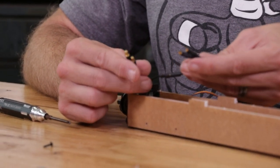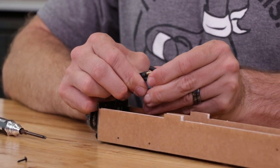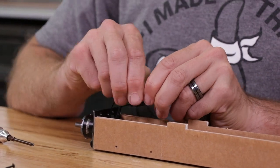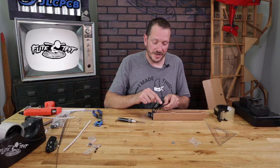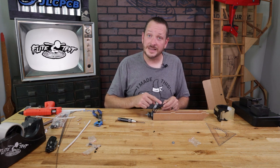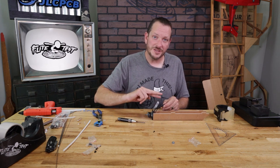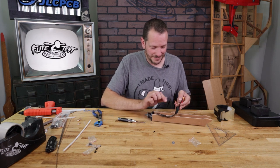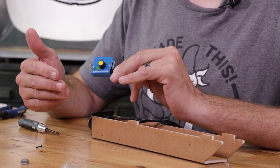To install the ESC, we're going to plug in our three bullet connectors. It doesn't matter which order you plug these bullet connectors in because we change the rotation of the motor by changing which connections we have. If the motor is running the opposite direction that we want, we simply select any two connections, switch them, and it makes the motor run the other way. So just go ahead and plug those in. Our next step is to make sure that our motor is spinning the direction we want.